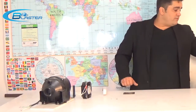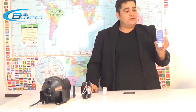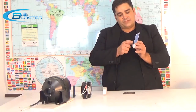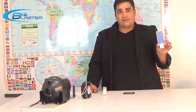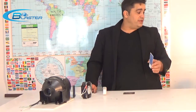We went from that to a new type of cell using electrified basalt, which is a volcanic glass. Again, we have the electrified metal on the back and the basalt electrified on the front. This is a real workhorse — this plate will get you about 5,000 hours and has been used in a variety of different types of ozone cells over the years.